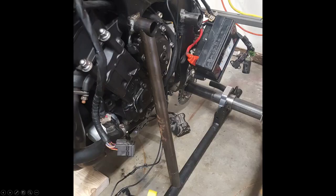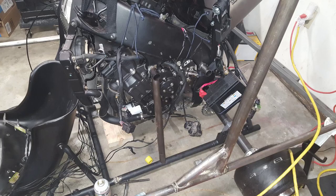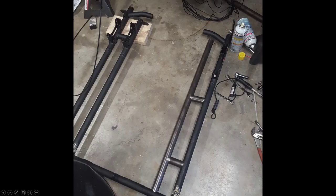This is the first mounting tube for the engine. Those pieces are just small cuts of tubing that I welded to little flat plates and cut into squares, then drilled a hole through the plate so a bolt goes through and uses the normal R1 mounting points on the engine, connecting the engine directly to the frame. There are three mounting points on each side of the R1 engine — one right here, one right here, held on with a bolt, and one down here that you can't see.